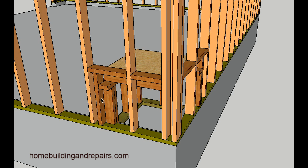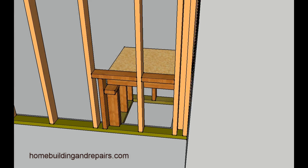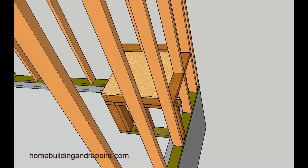Here are the blocks and the backing — you could always run this up and do the blocks however you wanted to; I think this looks the cleanest. I like to extend the top plate over here so that I can nail into the backing, giving me some extra nailing. If I didn't have this I could nail into the block and into the wall framing sill, but I always like a little more — it gives the platform a little more security and strength.